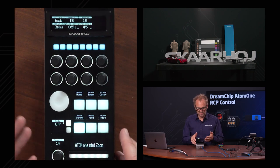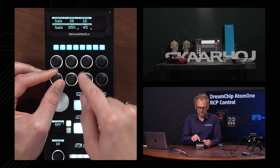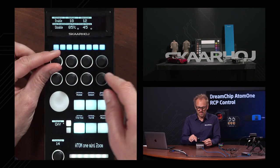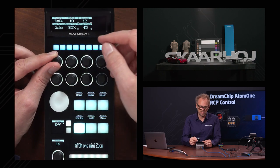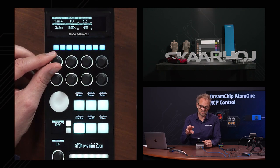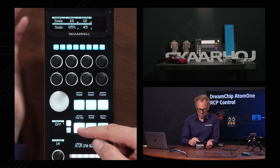Before we get there, let's just move to filter and knee. You see we have standard enable/disable knee, knee point, and knee slope that we can set here. We have filters as well, which is essentially how sharp the image is and how much denoising you apply. As you increase details, you have more noise, and you can compensate — those are available in this menu as well.